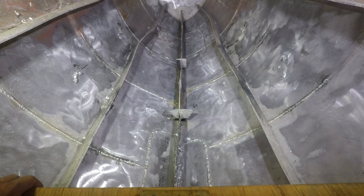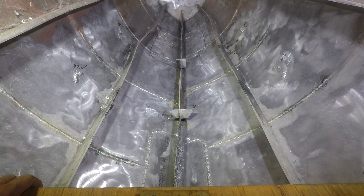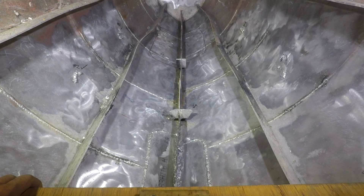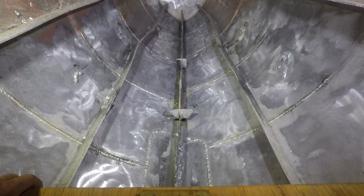This is definitely a work in progress, but she's strong and she's safe now. When I first opened up the doors to this section and saw what was going on, there was epoxy patches and spray box liner gooey stuff everywhere — it just looked like a heinous mess. Once I got all cleaned up and went through the process, it all sort of worked out. It's not something you need to freak out about, but it does need to be addressed. Maybe this video has been helpful and maybe it'll help you do the repair yourself — or maybe it's just giving you some information so you can guide the process and be a bit informed on what needs to happen. All the best. Don't be scared to try. Just get in there, spray some weld around, stop the leaks, and go sailing.